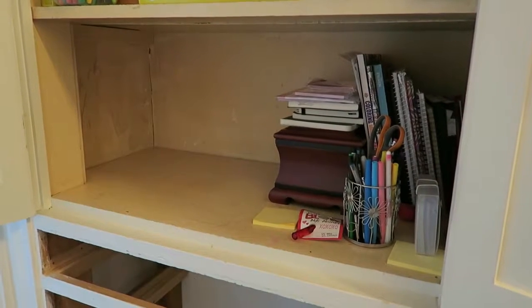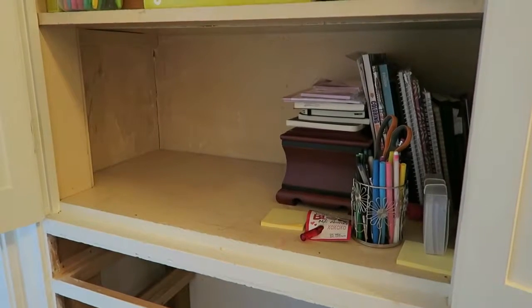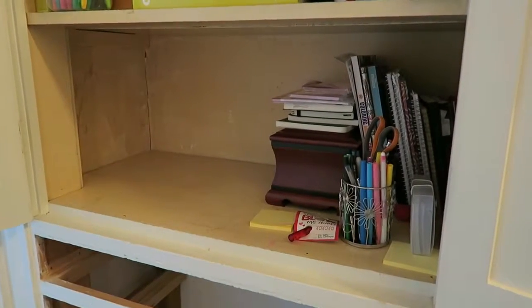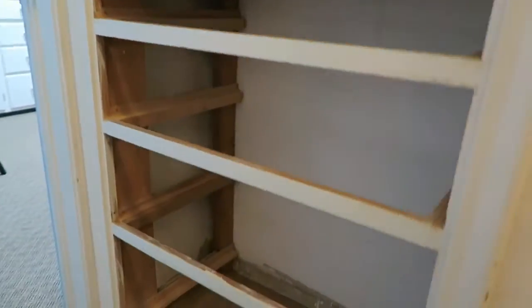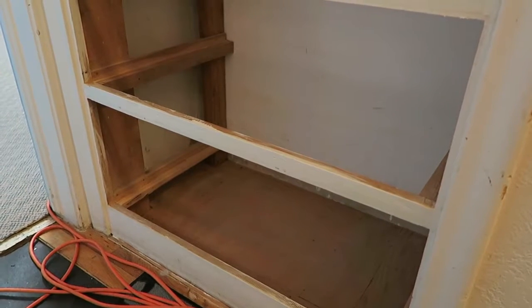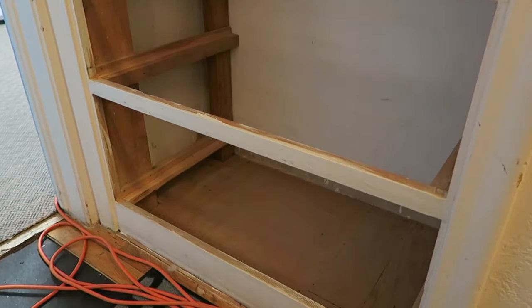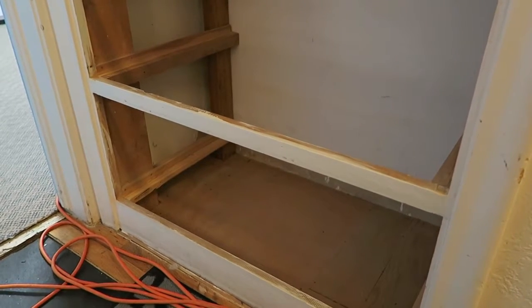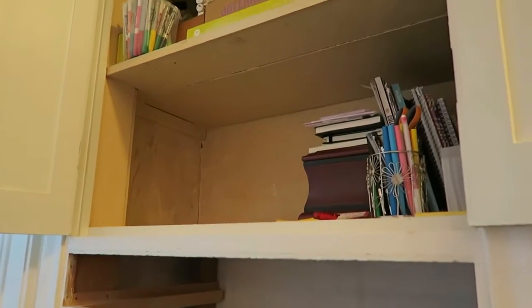The next best place is on top of the stove, and I'd like to keep those devices away from the stove and any food that might be splattering up there. So I'm gonna add an outlet over in this corner. We'll drill down through 3/4 inch conduit, and then we've got these built-in drawers, so I'll be able to drill down into the laundry room below, and I've got some wire down there I can tie into for electricity, and that'll work out perfect. So that's the plan for tonight. We'll hope it goes well and it's a quick, easy project.